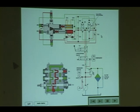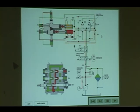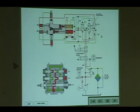If you take care of those two things, the wear part is dependent upon the amount of grit that's in your sludge. It varies from location to location, obviously. But the two most important things are to make sure you keep a clean water box and keep product in the hopper. Lack of either one is going to burn the rams up.